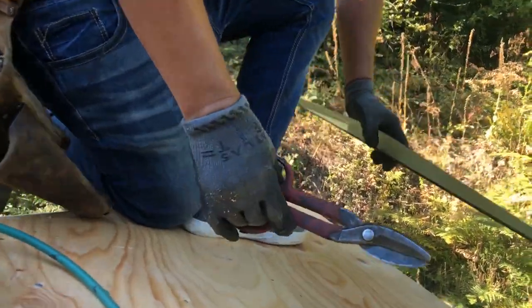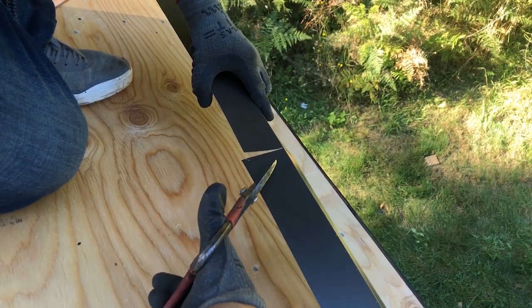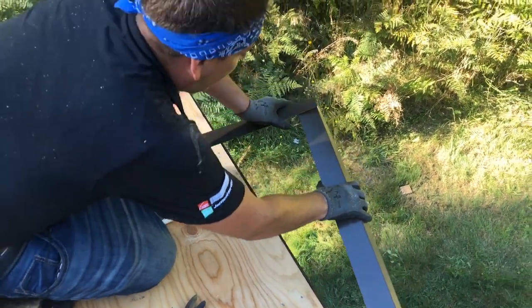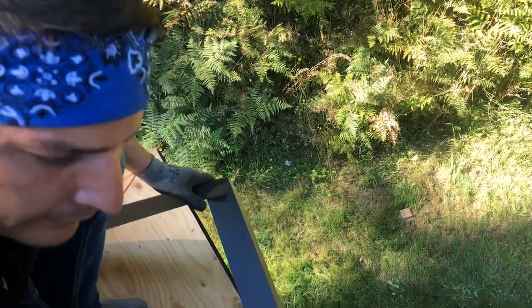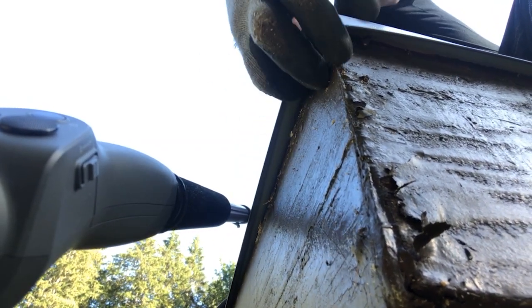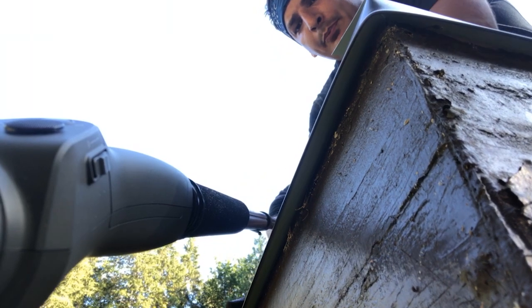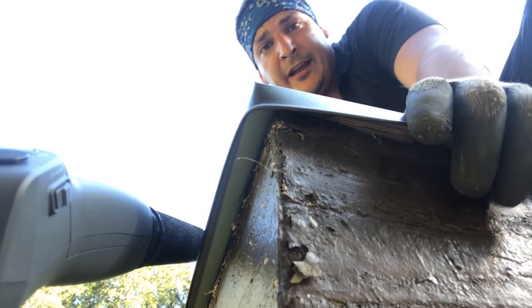What I'm going to do is cut a couple feet back, cut a little bit off of this, because that way it will have room to move. Otherwise if you bent it like that, it would have no room and you wouldn't get 90 degrees. So now that we got that, we can go ahead and stick this in the corner. I like to give a nice inch right here for the gutter guys.